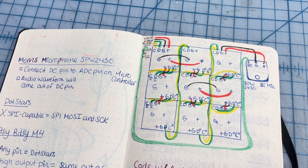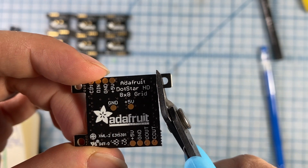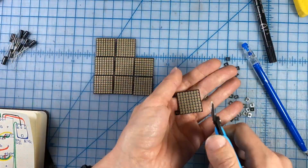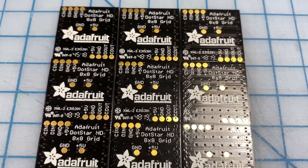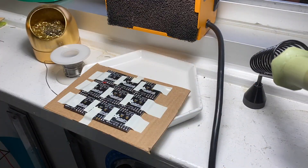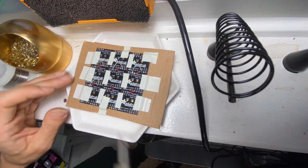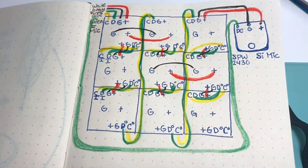I'll put links in the description to all of the products that I found so that you can use them too. The matrix was a matrix of matrices of these Adafruit DotStar LED grids. The mounting holes needed to be cut off to make them fit together, and I sanded the edges to make them sit nice and flush. I added some electric tape to hold them in place, and started soldering the wires according to my diagram. There were so many wires to solder, so to keep them straight I connected all the power, then ground, then data, then clock pins together. And when I was done, I had a matrix of matrices.